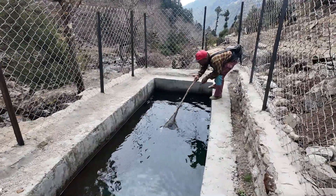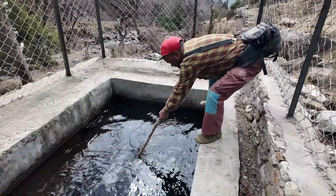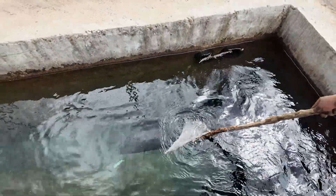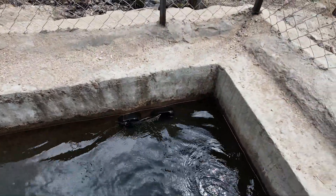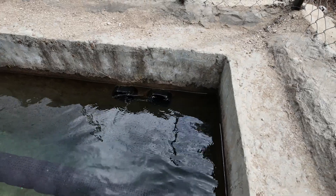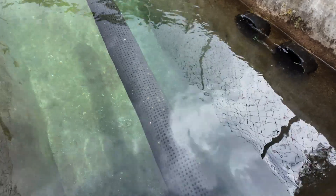Haribai is just cleaning the intake pipe, which has over a thousand holes. Through that pipe the water goes down to the penstock. Here we see the overflow where excess water flows back out into the river. The main pipe leading into the penstock must always be fully covered with water so that no air enters.